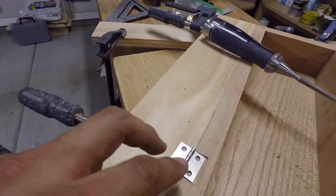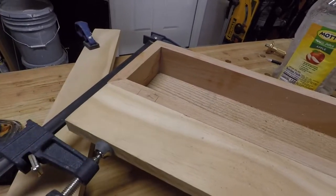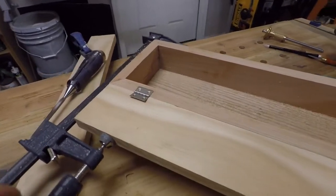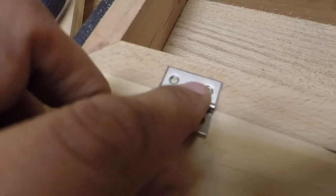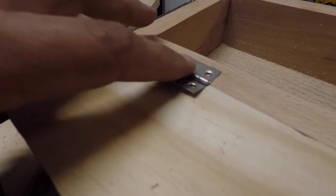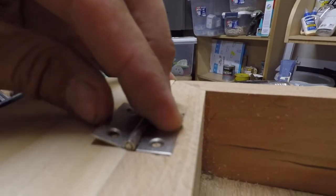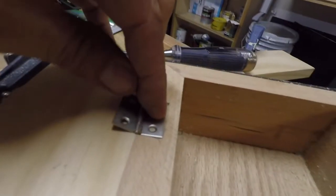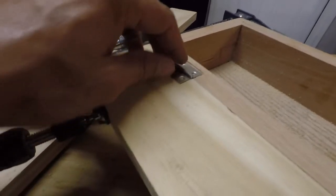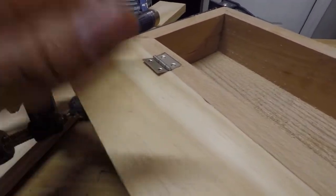It's a little bit of tear out right there - just clean that with my finger. The only reason it's not going to look completely flushed is because of the scrap board we're using to assist with the router itself. Once I take this board off it'll have a nice fit. Go ahead and move over from this side to this side - it's the same exact process. Now that both hinges are in, as you can see here, this is a nice tight fit. It's not super tight but it's not loose at all - it's very hard to move left or right. It is flushed with this portion of the wood itself. That is the final portion of this hinge and the mortise.